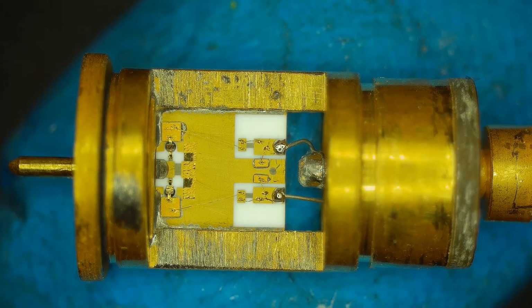Now, you say, okay, I can work with really, really small things. I'll just buy myself some replacement diodes. Well, you can't. These diodes are not anything you can order. They just aren't. They were special. We had a manufacturer that we worked with who built diodes, and once in a while, for whatever strange reason, by dumb luck, they built perfect diodes. They had really low capacitance, really low junctions. They had great, 40 gigahertz capability and stuff like that.